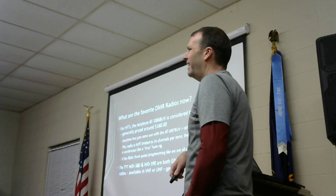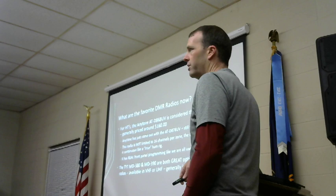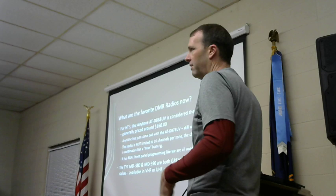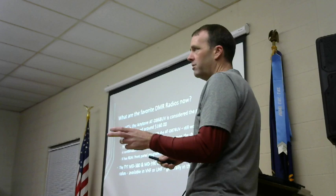Yeah, you'll have to download the software from Anytone's website or from Bridgecom or whoever your dealer is. Bridgecom is really good about having the latest firmware and the software. That's one thing you have to watch. If you're on 1.34 firmware, you only use 2.34 software. If you're on 1.32, you only use 2.32. So just make sure the numbers match up.